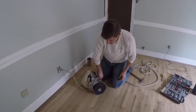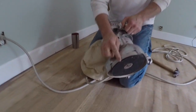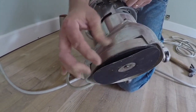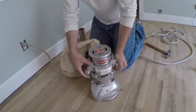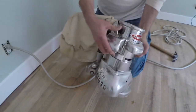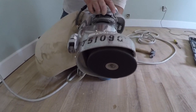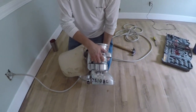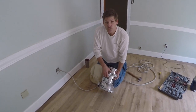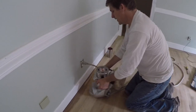All right. So now that you've got that on there, this is the part that you're going to get right next to the wall. The sandpaper will spin together with the disk once it's sitting on the ground, so this gets you really close to the edge. There's an on/off switch right here, located nicely for those of us who are right-handed. You just pick it up off the ground before you turn it on, turn it on, and then put it on the ground and let her go. Always when you start or stop the tool, make sure it's off the ground so it doesn't mar your floors.